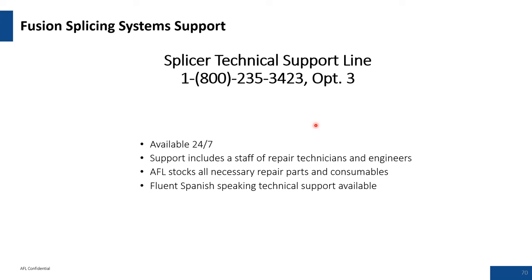Yes, awesome. So do we have any equipment which works with splicing rare doped active fibers? Certainly the 90S has some of those capabilities, and that gets into specialty splicing. When you're talking about rare earth or erbium doped fiber, it has characteristics that you have to adjust: your pre-fuse time, your arc power, your stuff amount. All that stuff is controllable within the 90S, and that certainly would be the system you should consider for that type of application. Awesome, thank you.